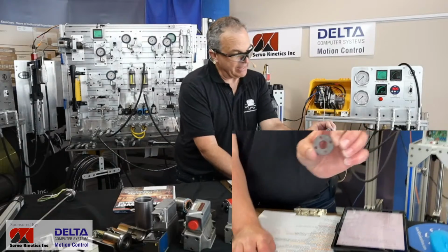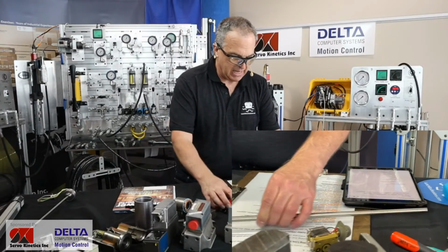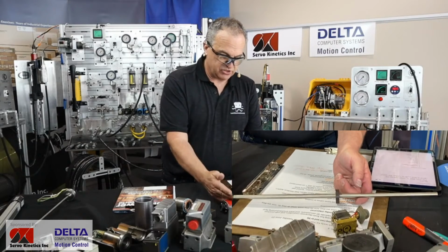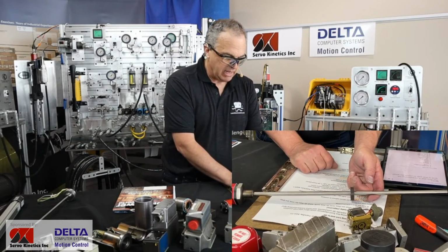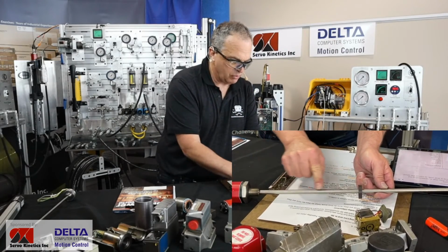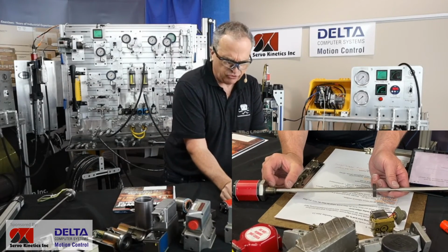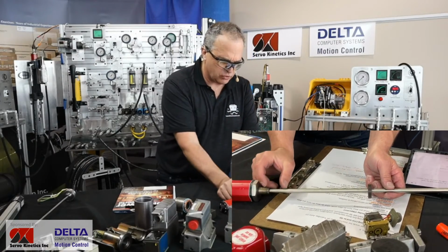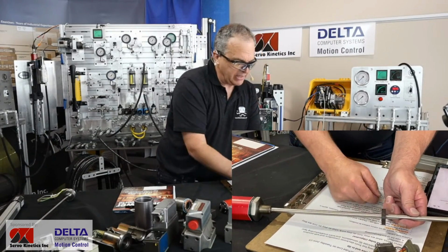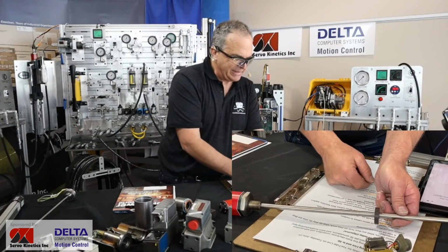And there's that magnet. That magnet is mounted directly on the piston, on the back of the piston inside. So as the cylinder extends and retracts, the distance from the sensing head to the magnet is measured. It's measured by sending out a pulse, a burst, down a wire inside the center of this tube, the waveguide, and that pulse travels, if I remember right, every inch of travel takes about 9 microseconds, but slight tuning differences for each unit. And when it hits the magnet, it bounces off of an intersecting magnetic field produced by the permanent magnet. That's why this style is often referred to as magnetostrictive.